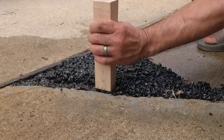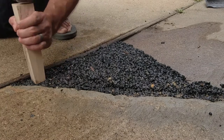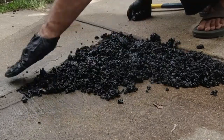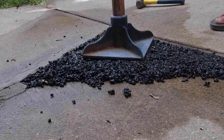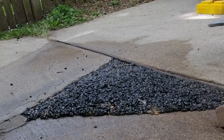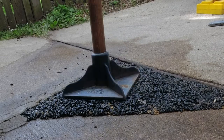Where it's a little more difficult is on the far edge where it's not contained — I need the water to ramp over it and drain toward the backyard. This is the second layer going in over the first compaction. I'm using a tamper and hammer, then a block of hardwood to simulate a contained edge and create a taper so water finds its way down toward the far end of the patch area.